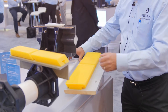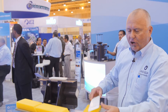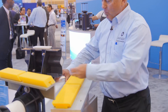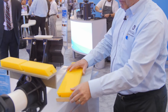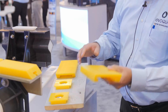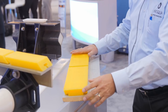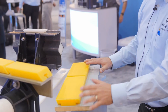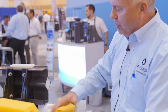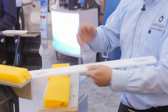These are the floor wear strips. Typically, this is your standard wear strip that's bolted to the floor. What it does is it has a tendency to curl on the edge — it's just 3/8 inch thick, and you have these recesses in here, so we see these curl up in the field a lot. What we ended up designing was mounting pads to the floor, having this system called a C-rail because of the shape. We just slide these on, slide them all the way along the floor. They're mitered for easy transition for the shoe, and it's long-lasting. This is a half-inch thick, and that's what you get — a half-inch thick wear surface. With the standard strips, you only get the thickness of what's left to the washer, and once that wears away to the washer, you have to replace them.